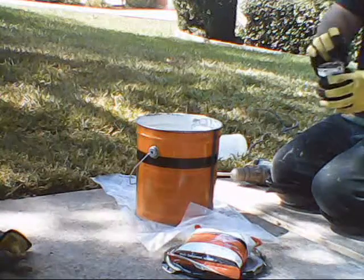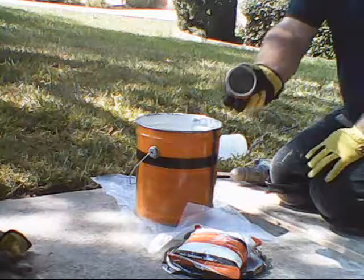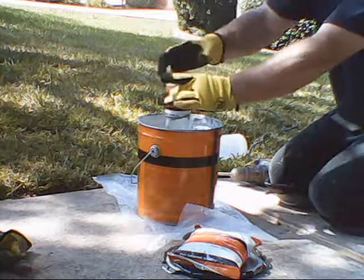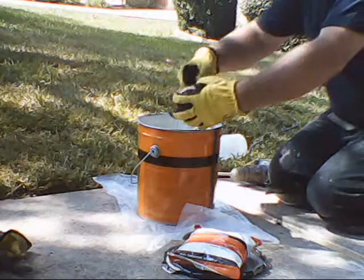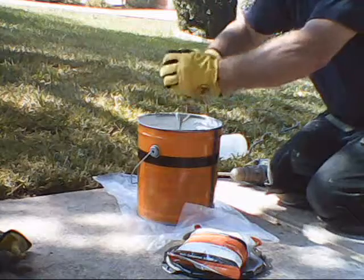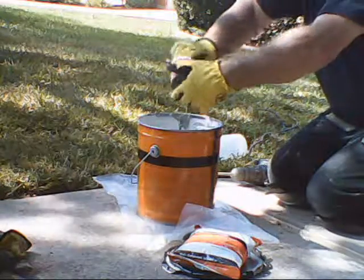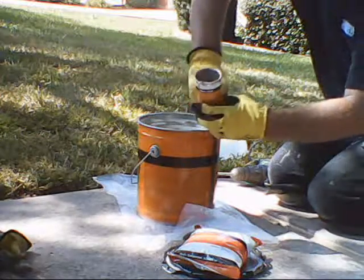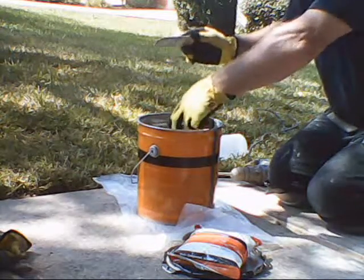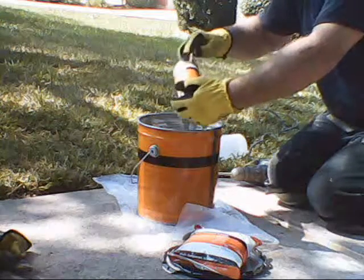Now you're ready to start mixing. Take your colorant - I usually add the color first. Go ahead and dump your coloring agent. We're using stone today - it's just a liquid colorant. To get it out of the bottom, use a regular mixing stick. It becomes really handy with this mastic, especially for squeegeeing off the edges and putting it back in. This stuff isn't cheap, so you want to get every little bit you can out of the bucket. I usually get between 30 and 50 feet of a 2x4 joint per bucket.